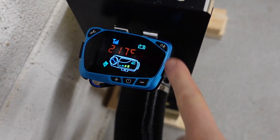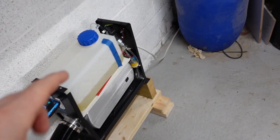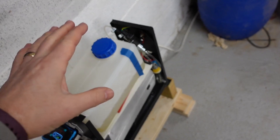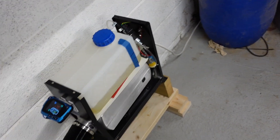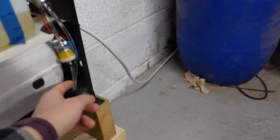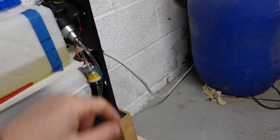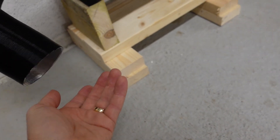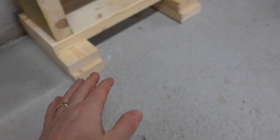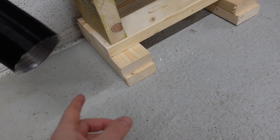The confusing thing is the combustion chamber temperature. Last night it was around 180 to 195°C, but this is sticking around 216°C. Also, the pump is modulating — last night it was a constant click-click-click, but now it's slowing down and picking back up. I don't know if that's because it's not at full bore, or whether the slightly bigger fuel pipe is allowing a more correct volume of fuel. The other thing is last night you could hold your hand in front of this all night, but now it's getting uncomfortably hot. The exhaust seems to be running cooler but the output air seems hotter.